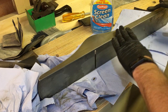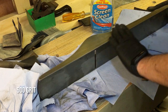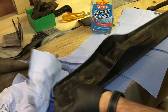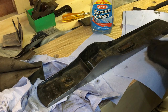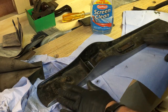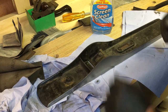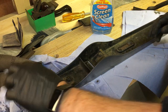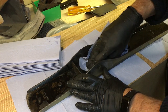I've taken it down to 400 grit. There's still some discoloration but for me that's good enough. I noticed on this one that the edge has the japanning on it — normally I'd take that off, but I'm not going to in this case. I'll give it a good scrub, clean it, oil it, and put it aside ready for the next stage. I need to make a decision about whether we need paint or not.